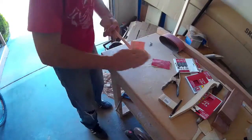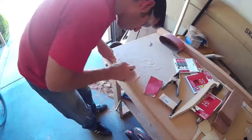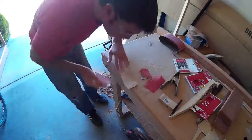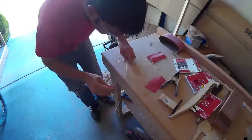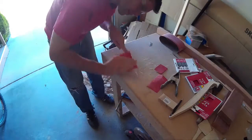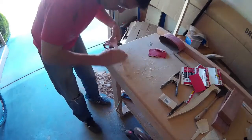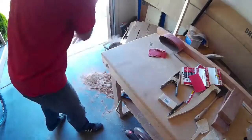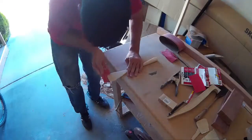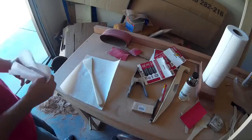Here you see me finalizing the overall shape of the handle and the tip. Then I'm refining the scoop so it's as even as possible — both symmetrically on the sides and in the actual transition of the curve. I sanded it for a while to make sure the handle felt right in my hand — you just have to do that by touch and feel. I wasn't trying to copy my original spatula completely, just using it as a guideline. Then I go back and use the blade to scrape it all again.